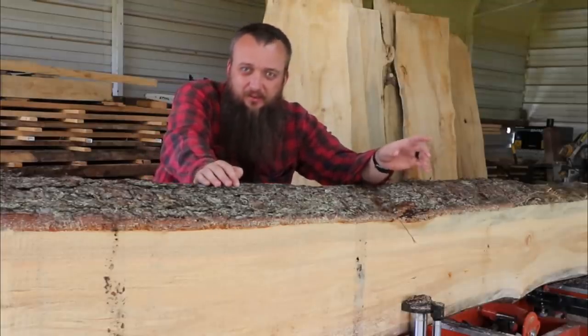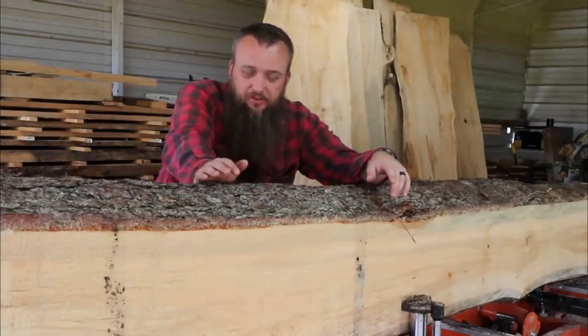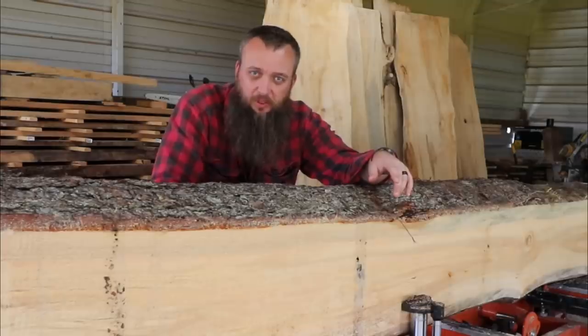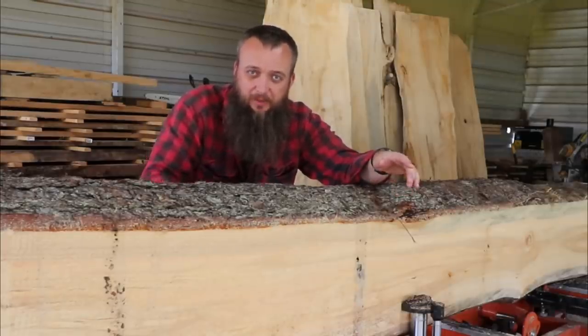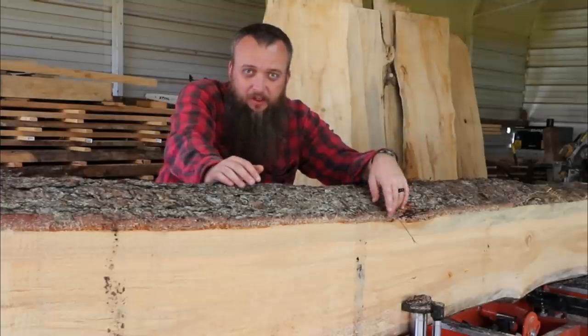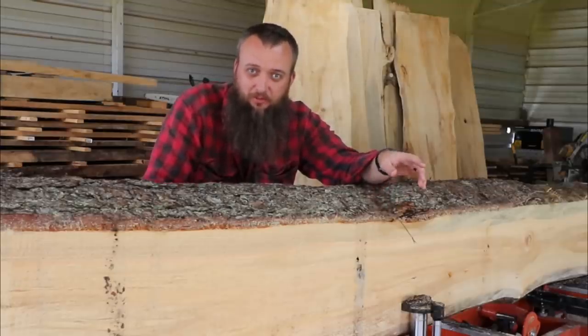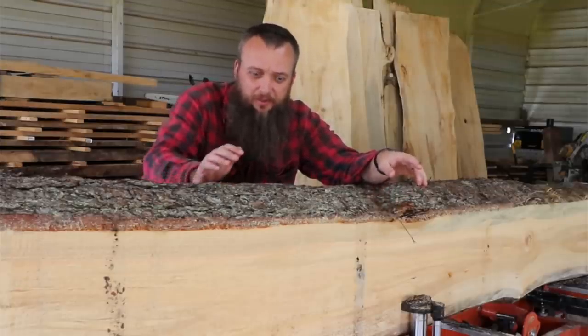What I mean is either I clamp too hard, because that clamp is so powerful, it will push these backstops over if you clamp too hard, and that will throw you out of alignment. And sometimes it's just a mistake you make. You bring that clamp over, you clamp it up, and you try to get it lined up perfectly on these back dogs, but sometimes by doing that, you push too hard and it knocks them out of alignment.